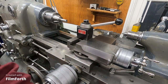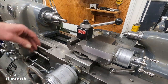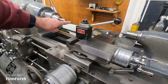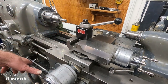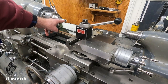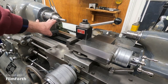Try to get it down there, and if it doesn't feel right, stop. And if you're using the half nuts, try to keep the tool an inch or so ahead if you can. Let it settle in. Put a little tension on the hand wheel. You have to do that on an Atlas lathe or the first thread will be off from all the flex. You can learn a lot on an Atlas, let me tell you.